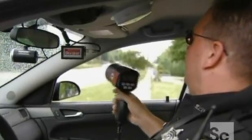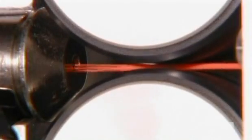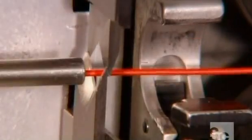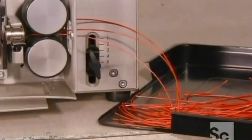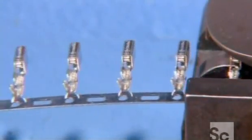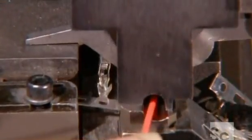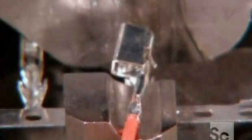But of course you can always try arguing with the officer. Making a radar gun starts with cable wire — lots of it. Rollers straighten it, then automated blades cut it to length and strip the plastic casing at both ends. With the wires now exposed, they're ready for the metal contacts that will allow wiring interconnections. A technician places the exposed wire in the contact and a machine crimps them together.